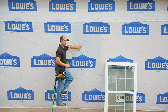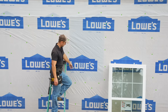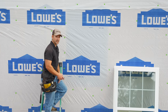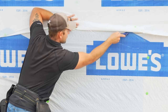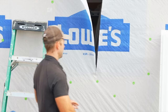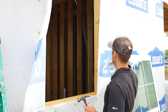The first thing I need to do is cut the house wrap where this window is going to be placed. There are several ways to cut it — you could cut an X shape from corner to corner, or cut an inverted Y. But in this case I find it best to cut straight down the middle, then cut flat at the top and bottom, and fold it into the opening. I'm going to cut right across the top of the window opening, then straight down the middle, then straight across at the bottom.